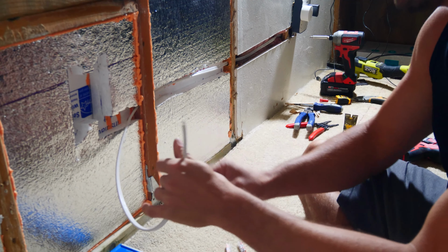Before turning the power back on, we'll slightly prepare the other end of the wire that will be going into the new box. We'll strip the black and white wires, and then add on Wago splice connectors to them to easily remove them when we're ready to fully attach everything.